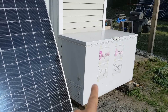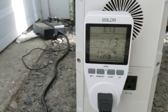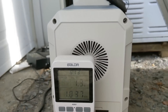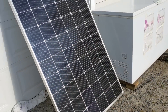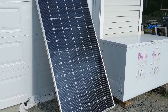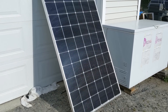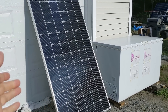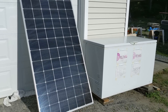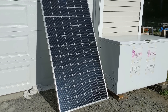It's been exactly 48 hours powering this chest freezer turned refrigerator using the solar panel and this little portable power station from Bluetti. And it looks like we're just over a kilowatt hour — 1.037 kilowatt hours — and it has not shut off. It's been running both nights. The first day I did move the solar panel in the afternoon to catch some afternoon sunlight, but the next day I realized I didn't need to do that. There was still plenty of battery life. The battery could last three and a half days with no sun, and the solar panel can recharge the battery in one day. I think this is actually pretty viable if your loads are really small, like just having a single fridge or freezer or a few lights and you don't want to go through the hassle of building your own system. You really could just buy this.